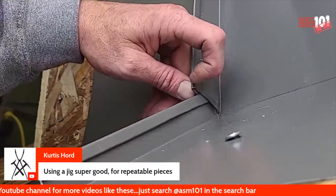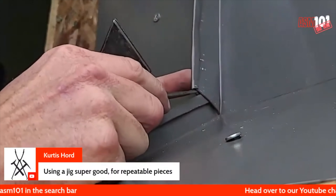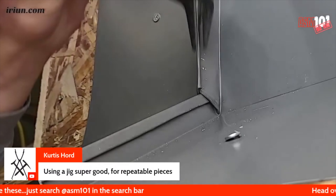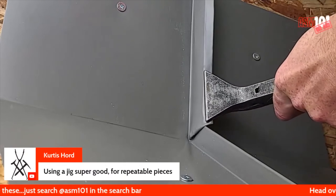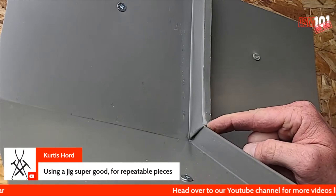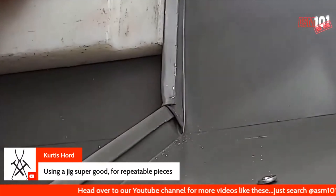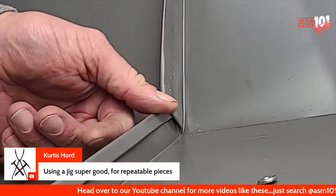You can see how that seam is buried up into the female. Before we fold this over into a double fold, it has to look like this — if it doesn't look like this, do it again. We're grabbing and turning. See how this is stretching along the top of that seam? Once I got it to this stage, I like to use my hammer. I hope I explained it well enough that you understand the importance of some of these finer details.